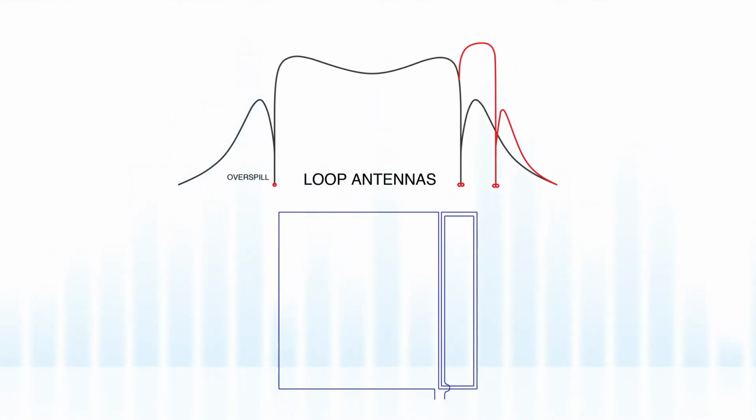This solution has very little functional application, since the signal and usable area would be the same by simply eliminating the small two-turn loop. It is usually just as effective to reduce the size of the main loop without adding the two-turn loop along the edge.